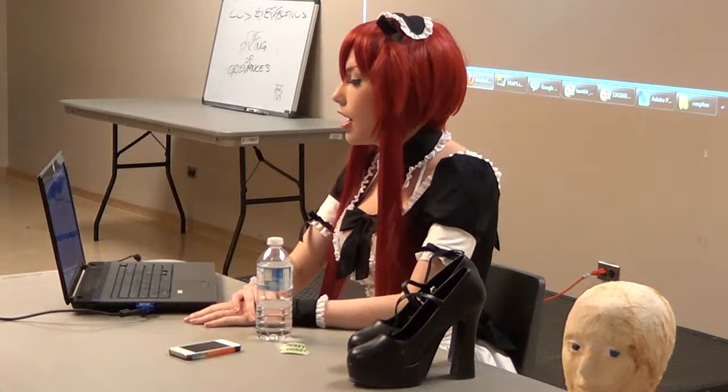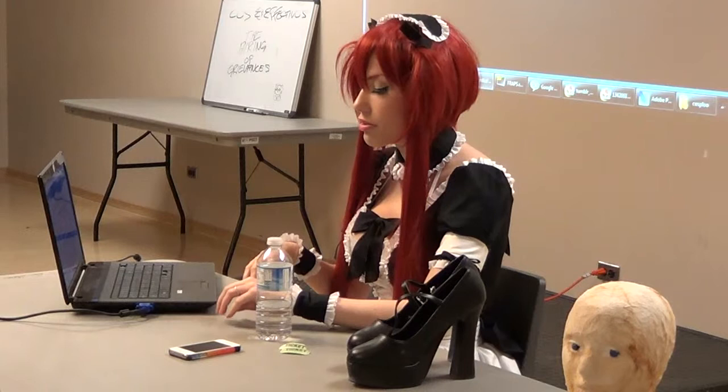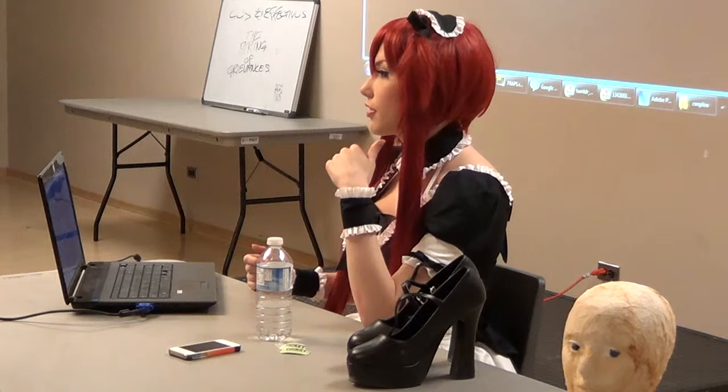And then for the fiberglass shells, that's basically a resin and then fiberglass mat. So basically you will coat your gel coat or your silicone that you've put on with the resin, and then you'll put on the fiberglass and then coat that again with resin, and you do that for a couple layers. It is messy, and I would highly recommend getting some cheap coveralls while you're working on stuff, otherwise it'll get in your clothes and be super itchy.